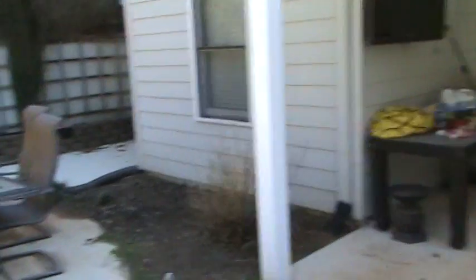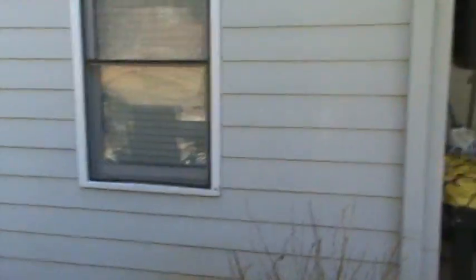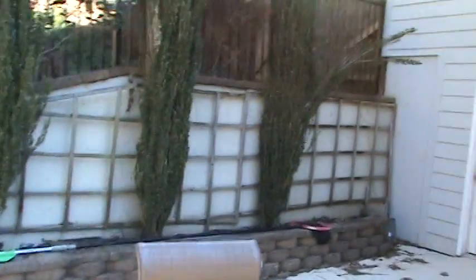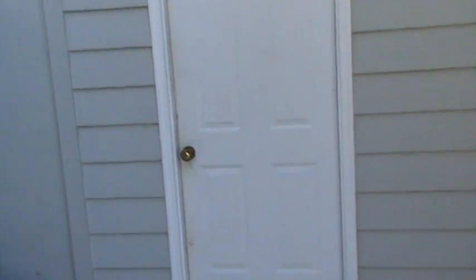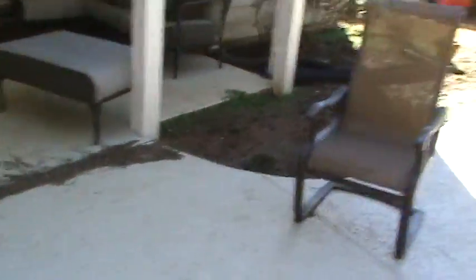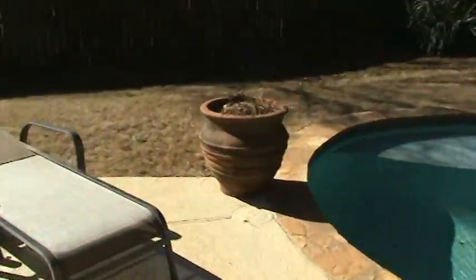On the back side, the middle window has some rotted brick mold on the bottom right corner. On this door, the top brick mold is rotted out and the left and right frame and brick mold are both rotted out. This gutter is dumping a ton of water right here and it's got nowhere to go because of the pool. We'd replace this gutter in this corner — about 22 feet — and run the downspout down the line to drain down the hill. He may need some sort of terracing to deal with remaining water, but at least he'll keep it from dumping in here; he can come back and do lava rocks or stonework to take care of that issue.